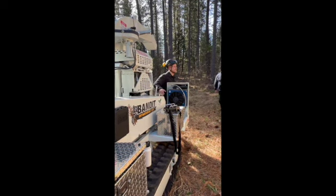So it's broken down. You're going to have a few daily points that we're going to touch on as we go around the machine. A lot of new operators see these grease points. They think, hey, I need to hit these daily. You pack too much grease in here, you will over-grease this clutch. You will be buying a new clutch. So just make sure you hit it. It's 1 shot every 100 hours. You're simply just lubricating this arm for that tension or that motion there, so it goes with it.